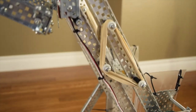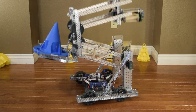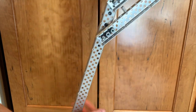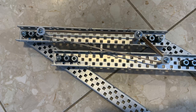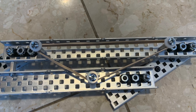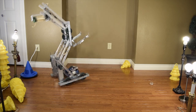Rubber banding is a very common technique used on lifts, as the rubber bands help fight the weight of your lift, helping reduce strain on the motor. This can help you lift more, as shown in this robot for In The Zone I worked on — it was able to lift a three pound mobile goal using just two 393 motors. There are two main types of rubber banding: linear banding and triangle banding. Linear banding is much simpler; it involves finding two points on your lift that start off far apart and get closer as the lift is raised. Triangle banding is more complicated, but if done correctly could result in much more uniform tension as the lift expands. The goal is to find three points that create a right triangle when collapsed, but move to form an equilateral triangle when extended. In terms of number of bands, there is no set number — it just depends on your lift and how heavy it is. You basically want to have enough rubber bands so that the lift starts to move on its own, then remove a few so that the lift can collapse all the way.